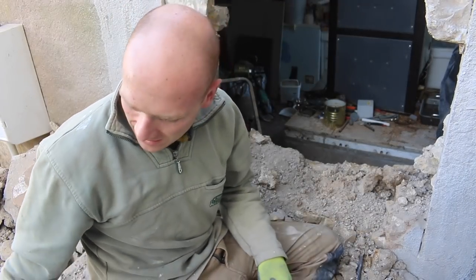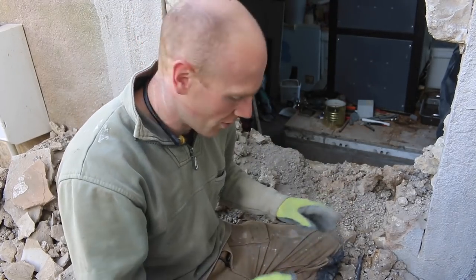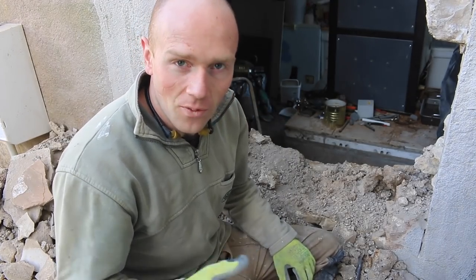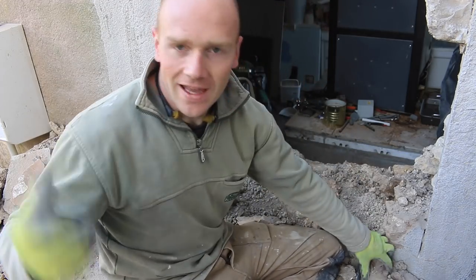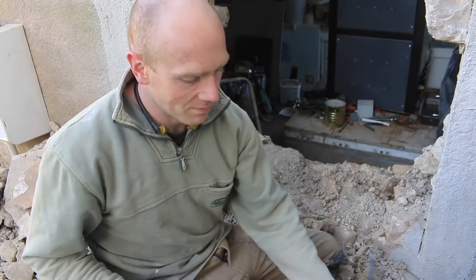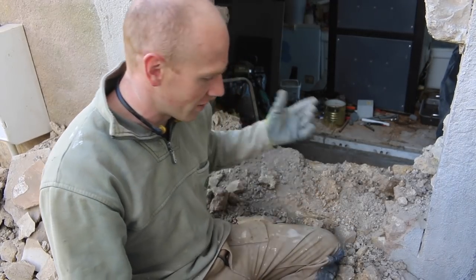Just a very quick video today — this is part of another video taking down the wall, but I thought I'd just mention: when you're working with old stone walls like this, it just shows how well things were done back then, and the benefit of lime. I've mentioned it again and again when we've been plastering or restoring the house, but you just cannot beat lime for a mortar when you're using natural stone, especially in a solid wall like this.